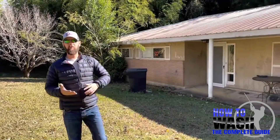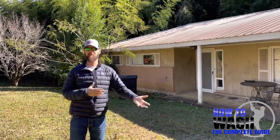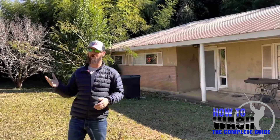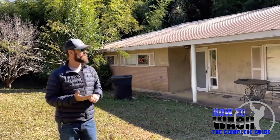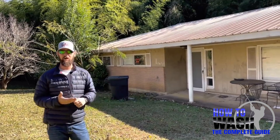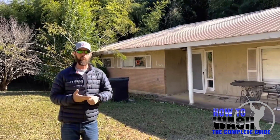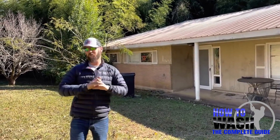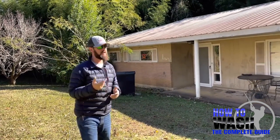When we're talking about a metal roof, the differences versus an asphalt shingled roof, Spanish tile, slate, shake roofs — today we're looking at metal. What are the things you need to know, and what cautionary things do you need to do to make sure you don't damage this roof in the process? Number one: we don't use any high pressure when cleaning a roof. That's pretty much across the board for any roof — we're not going to pressure wash it, we're going to soft wash it.